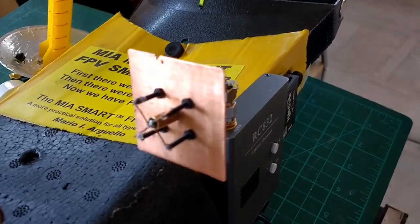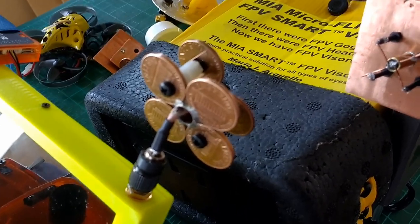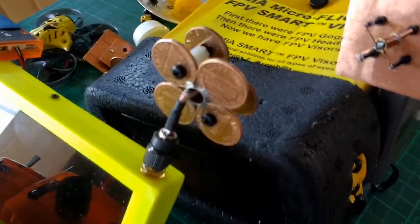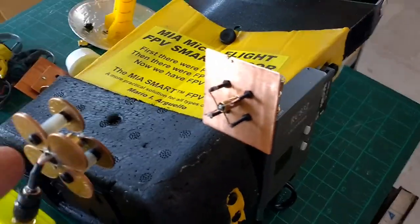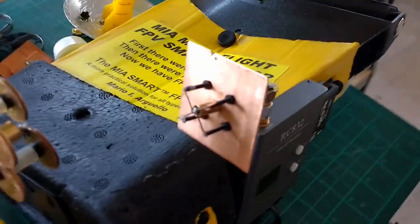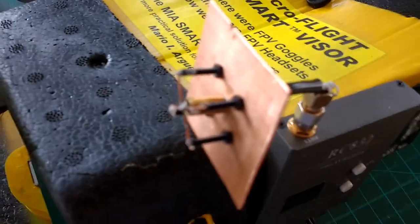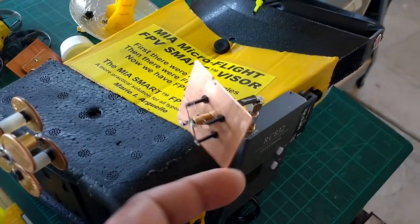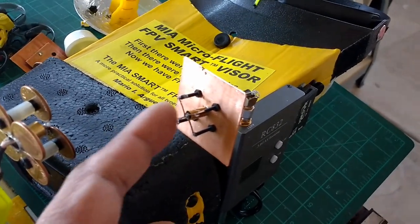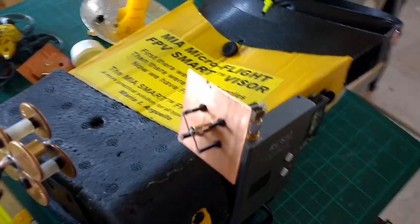So this is yet another antenna that I did just to have a reference, because my mind has been set on making antennas with pennies. And what you're seeing here is the penny version of this antenna, if you will. Now, I did change some things here, such as the balun, which is the tube that sits inside the plate here, and that's there for, once again, tuning purposes, impedance matching.